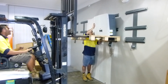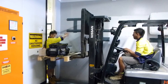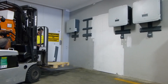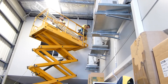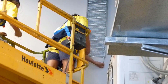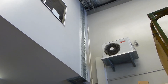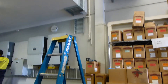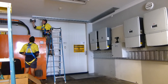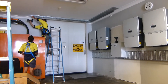We now move downstairs to the dedicated inverter location where we carefully place the ABB three-phase inverters onto their wall mount brackets. This process is done outside of business hours to ensure that minimal disruption is caused to the business. After mounting the last inverter, we move onto installing the cable tray to provide a secure and safe channel for the DC cables carrying the solar energy from the roof to the inverters. We also install a cable tray around the walkway to carry the AC energy that the inverters have created from the DC solar supply into the main distribution board. From here, it's simply a case of final safety inspection before commissioning the system.